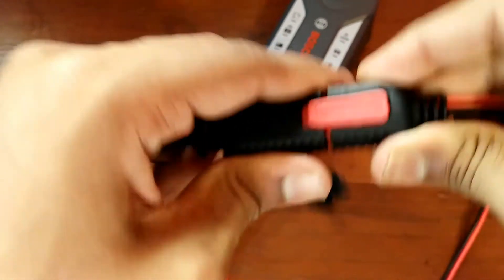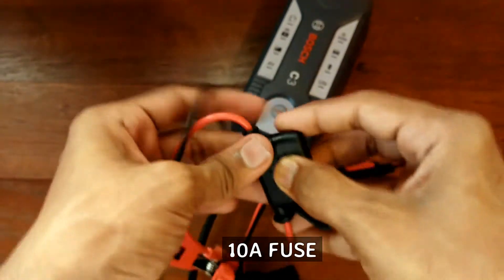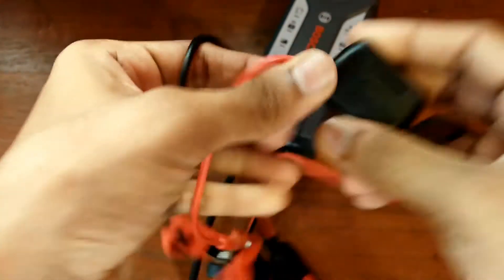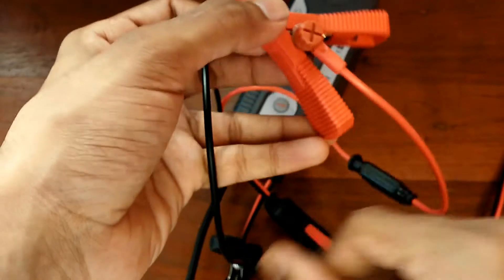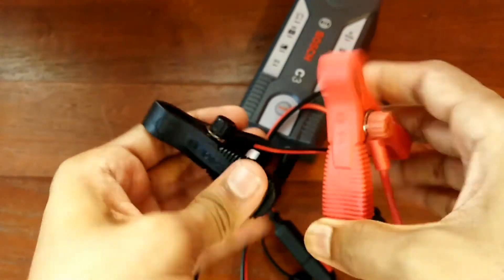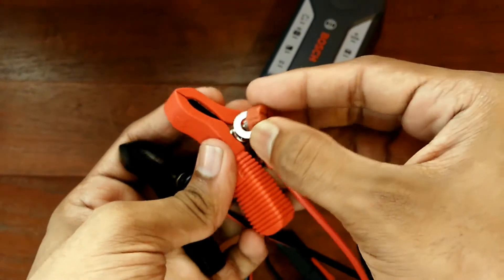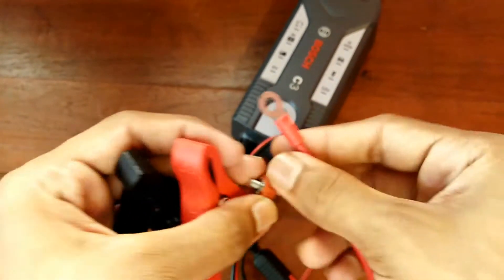Now let's talk about its technology. The battery charger is controlled by an internal MCU microcomputer unit for intelligent monitoring and automatic charging at all times. The charger detects battery voltage automatically, enabling automatic pulse and trickle charging modes. If a 12 volt battery drains below 10.5 volts, the charger detects this and starts charging in pulse mode, which helps remove sulfation and also charges faster. However, if your battery is too old, the charger may fail to detect 12 volts and start charging in 6 volt mode, which is not ideal.